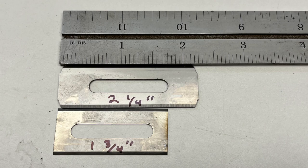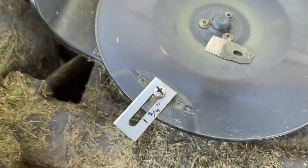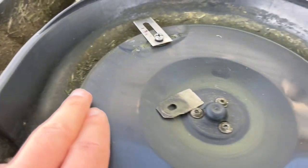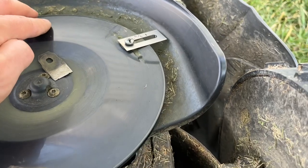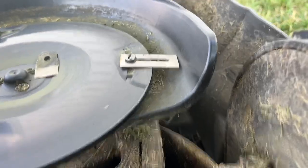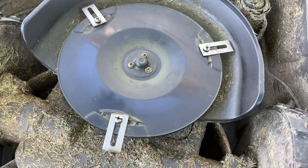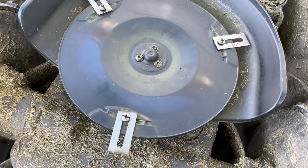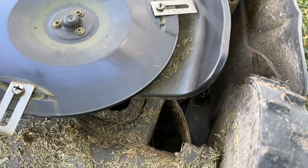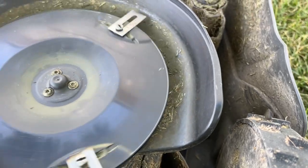So back to the grinder to take a little more off. Now they're one and three-quarter inches, and as you can see, the blade barely clears the deck. It is usable but does not leave much room for error — it was close enough that it seemed worth a try. The old blades are off and the new blades are on. These carpet blades have all been shortened to one and three-quarter inches in length, which is the maximum length allowable while still clearing the deck.